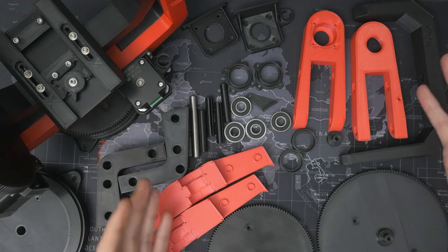Now we're on to the fun stuff - setting up the motors and the electronics. I'm using a couple of NEMA 17 motors. You could potentially go with the slimmer pancake steppers and I might swap these out eventually, but for now this is what I've got. The plans for this gimbal do come with a couple of little 3D printed spur gears for the stepper motors, but these gears see the most wear and tear, so this time around I picked up a couple of metal spur gears - M1 T16 - from AliExpress.